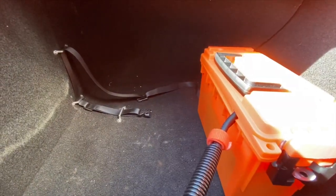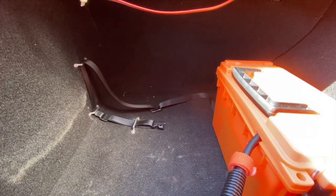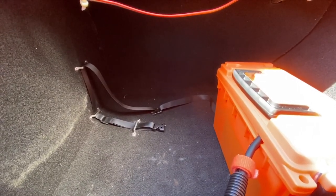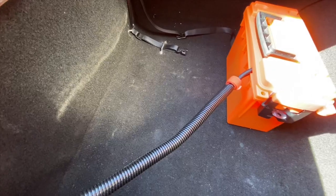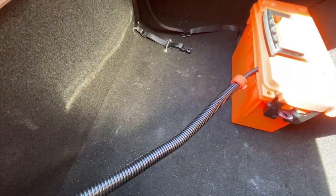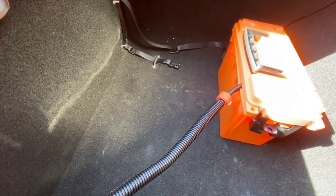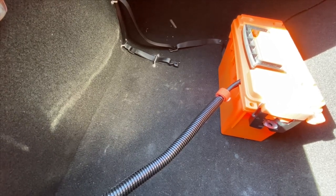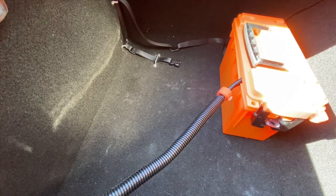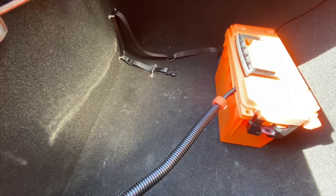I secure the battery box with a nylon strap with a buckle and just a couple of cleats — I was able to find all of that on Amazon. It holds the box and battery really well. I'm running a ground wire from the black box GLS-10 to the negative post on the battery. I read that you had to do it either to the negative post on the battery or to a water ground. I haven't had any interference, so I think that'll get the job done.